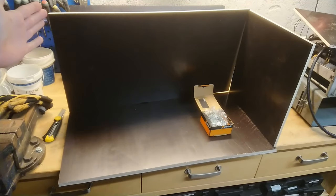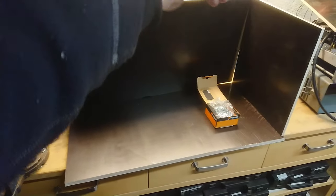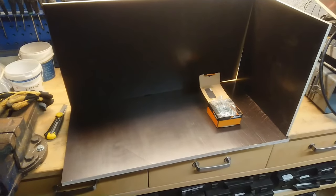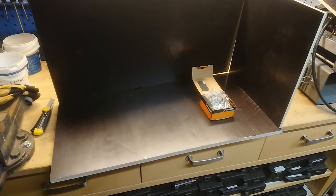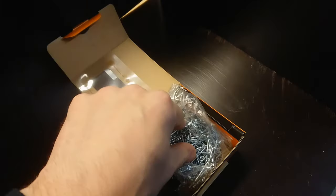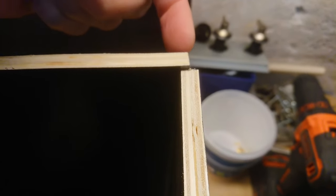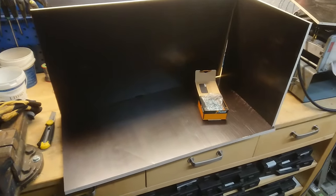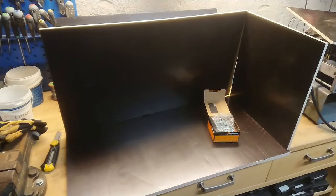A box like this will be kept together with just some thin nails, because it will have aluminum rails all around all the edges, which will really stiffen up the whole construction and also not require that many screws — it will be riveted together. To put the box together first, I will use these small round nails, going from the edge to the middle of the other board. I'll put the sides together first, then put on the top and the bottom, and then I'll have a completely closed box that will then be sawn open to get a nice even cut for the lid opening.